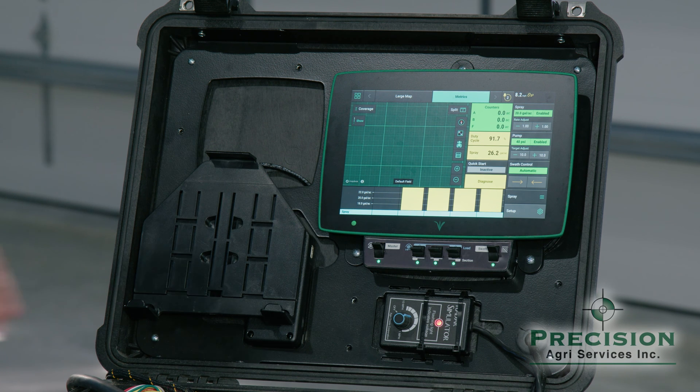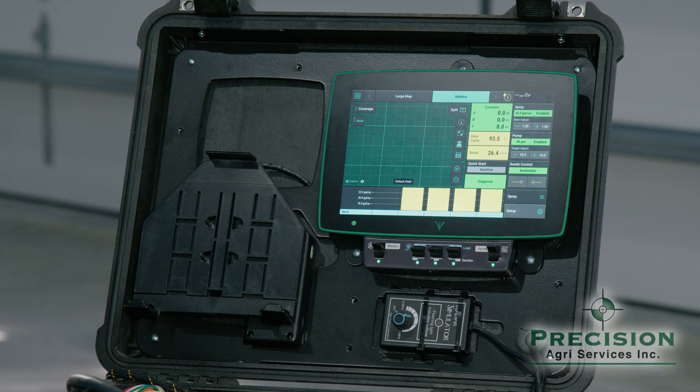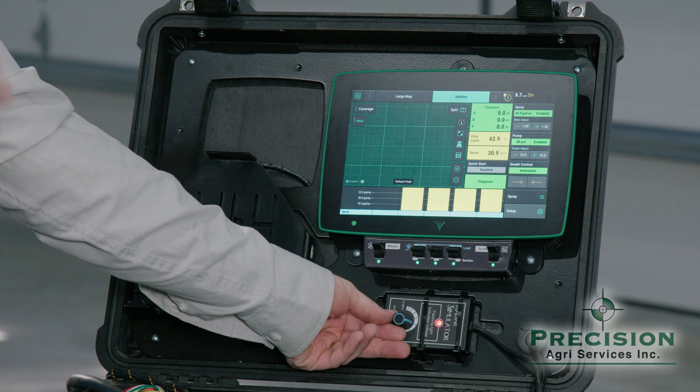What we're able to do is keep a consistent rate and consistent pressure whenever we're doing that — we're just opening the nozzle system more. If you listen to the clicking of the nozzle, the clicking is happening much more fluently. Versus if I slow it down, you can see they're definitely slowing down — they're not as open as long.